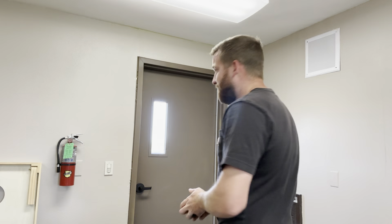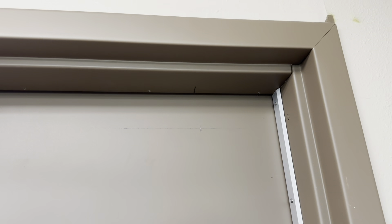I'm going to mark on the door and it'll make more sense. Bringing it in close, you can see my pencil marks. This is the three inches where it's dropping down. Three inches down, and then this is going to be six and an eighth from the edge of the door — that's what they're recommending for the 120-degree open. For the plate that goes up on top that the arm attaches to, they want six and three quarters from the door frame over.